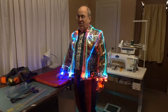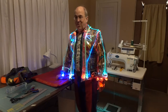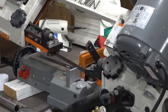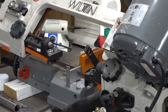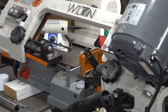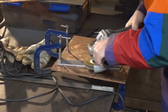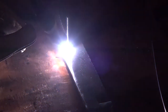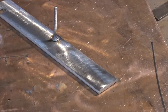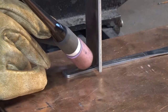It's time now to get going on the sculpture for the interface auction. What you see me doing here is cutting a former bracket that used to hold a shelf in a very elegant high-end store display. It is not uncommon to see elegant store displays from high-end stores that end up at the re-store and get used by sculptors. Here you see me welding a screw to one of the support brackets. The trick is welding the head of the screw to the back side of the bracket so the front side, which is what the public sees, is unblemished.